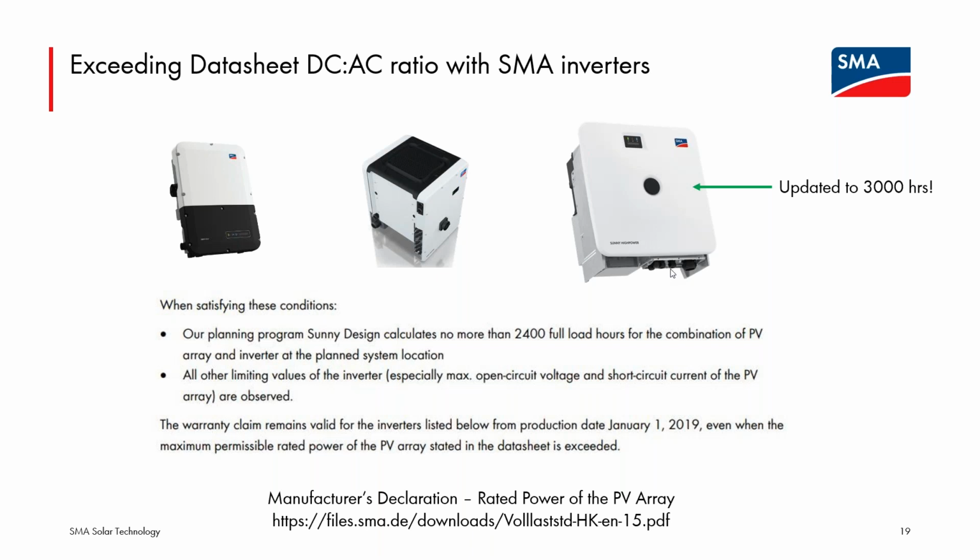So if needed, it would have to be in the combiner box for the PEAK3, and then obviously there may be requirements on how the output of the combiner box is routed to the inverter. Maybe that has to be buried or clad in a metallic conduit, kind of an MC cable. But based on the architecture of the PEAK3, I don't believe it will ever have the built-in AFCI.